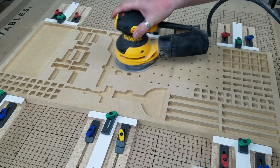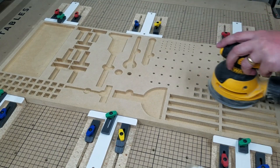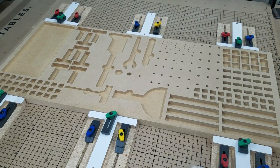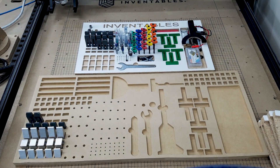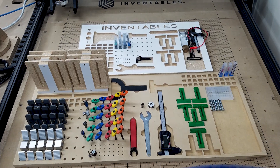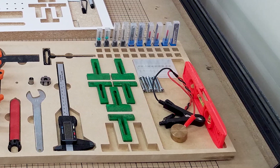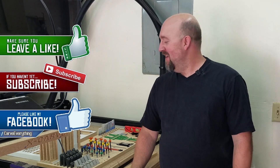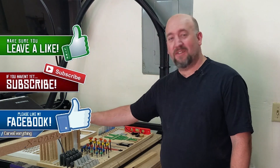If they don't fit, copy those selected areas into another project page on Easel and enlarge as needed. That way you've still got your exact spacing of where the pieces go and you don't need to worry about re-zeroing because you can zero at the last zero point. So that's it for the bitboard. If you liked what you saw, consider subscribing and please give it a like. I'll have this posted in the link description below so if you want to carve anything you've seen in the video, it's there for you. Thanks for watching.